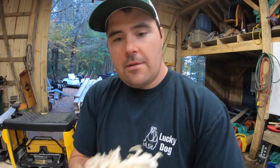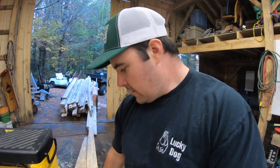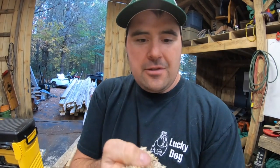The reason being is the ones I just picked up, these are from a sharp planer blade. These things are brand new. They are razors. These are dull as heck. These are taken off wood, but not much, and it's actually causing some problems and some roughness to the wood.